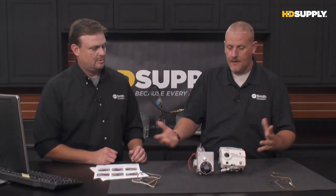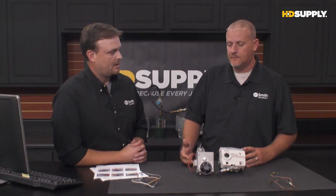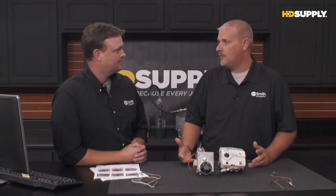Sure. As you stated, we don't plug this water heater in, right? Traditionally, atmospherically vented water heaters do not need any type of wall outlet or anything like that. Now, once you go to an electronic control, then of course we're going to have a little bit more power. If we're going to run things like status lights, those type of things, then we're going to have more power than the old mechanical style.